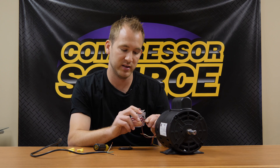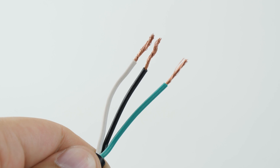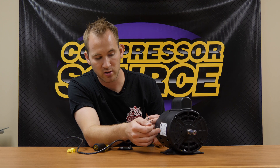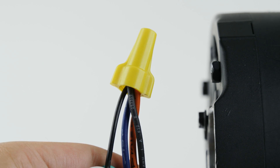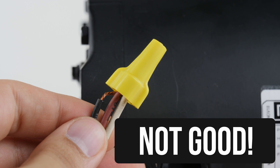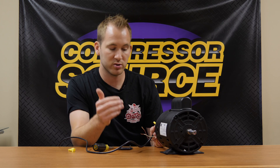The diagram also shows L1 getting connected to this group. L1 and L2 are either your white or black wire from the power cord. On single-phase 110 or 220 volt, swapping white and black is not going to change the rotation or how the motor functions. So select one wire as L1 — which connects to T5, T1, and T3 — twist all these together and put a wire nut on. It's very important to make sure no excess wire is hanging out and all wires have a good connection, otherwise you can burn up the motor or cause a short inside the cover.